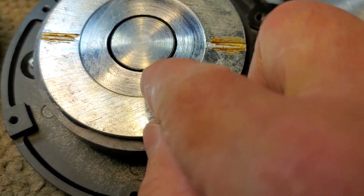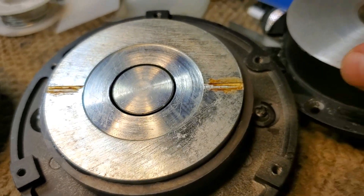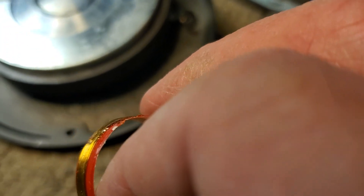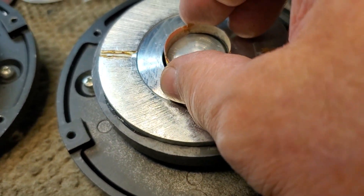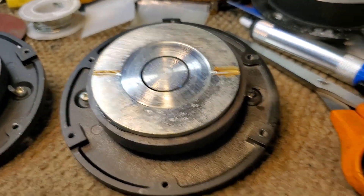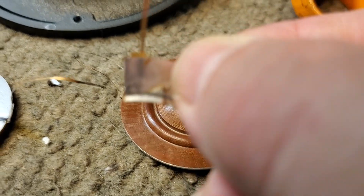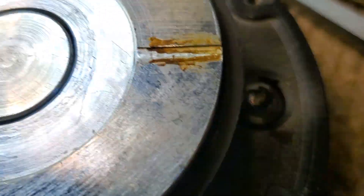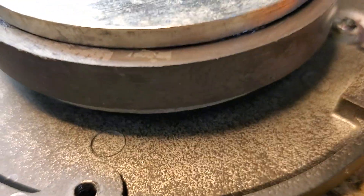On this one, I actually had to take the top plate off and re-bond it because the voice coil was down in the gap — it came off the diaphragm mounting that came off the ring. So it was a challenge. I had to measure up some shim material and ream out the top plate. It's not trivial.